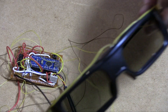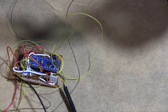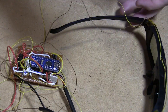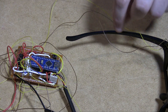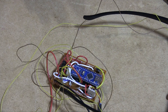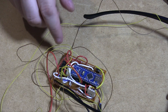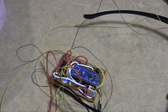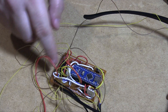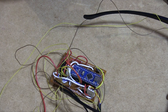So here's our actual setup. We have our 3D shutter glasses — standard television ones. These are Panasonic TY-ER 3D 5MAs, but anything with shutter lenses should work as long as you can find the points to power them. Our board is a bit of a mess. If we can get this working properly — it's not working entirely properly yet — we may make a circuit board just to make it a little bit neater. We did add in the 12-volt power lead but can't get that working; I think one of the enable pins is wrong somewhere. Something's not being either pulled up or pulled down that should be.